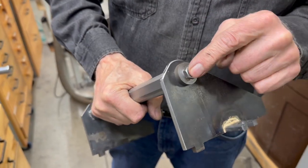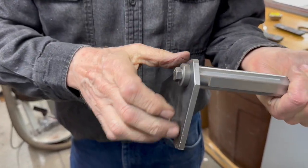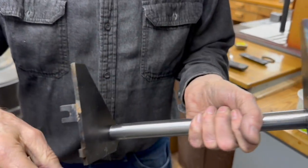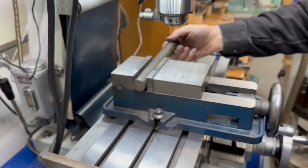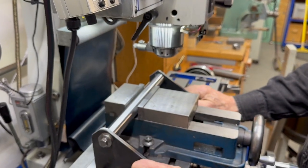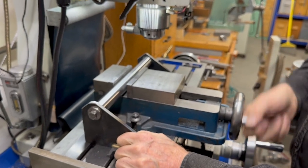What I've used here is three-eighths bolts with fine threads so I can get them good and tight, and they made a special washer for it. So this is pretty solid — it's not going to move. I tightened them up as tight as I could without stripping them. Because this is quarter inch steel, it stays pretty good. Nice, fine finish on the backside. The front side doesn't matter because that's just loose. But when I put that in there, there's absolutely no play this way because it's up against that jaw — there's plenty of play the other way because of that.